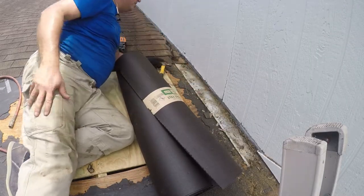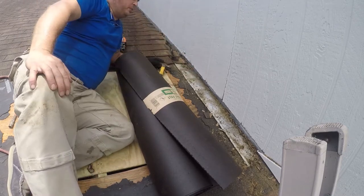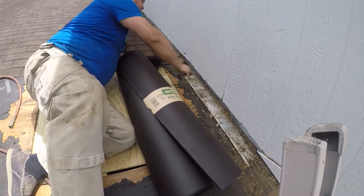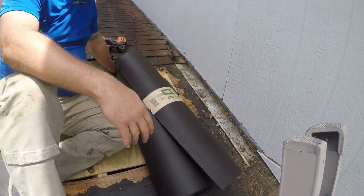Smashing against the wall. That's what causes leaks. All the nails should be up here on the wall where the water won't pool. So I gotta go get some mastic to seal those holes so it doesn't cause more issues.